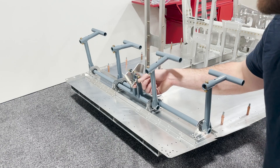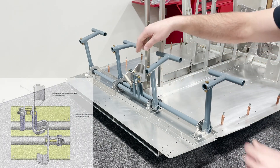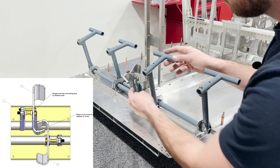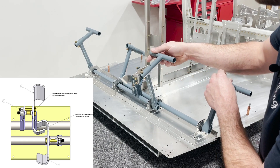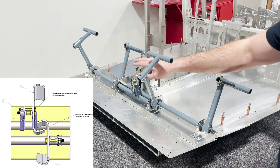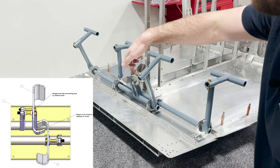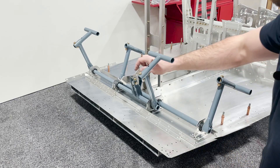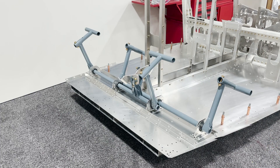Greasing the rod ends now is your best bet before much more of the assembly is put together. The last thing is to make sure the flanges clear all of the other internal assembly components by at least three millimeters, and they should overlap by at least 10 millimeters when they contact each other. It's a little bit of trial and error getting it to fit properly. The parts are usually cut perfectly, but if you need to file down just a millimeter or two off the edges to avoid interference, that's okay — as long as you've got 10 millimeters of overlap on this component.